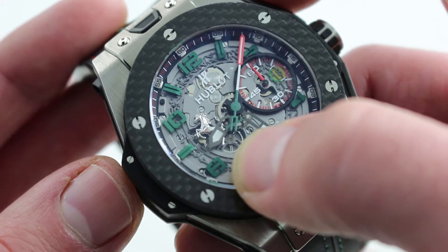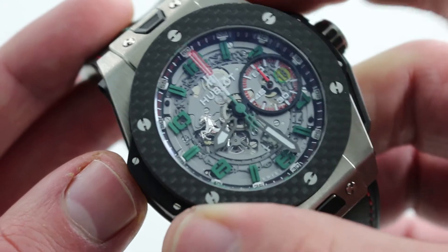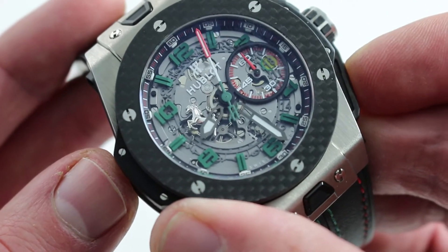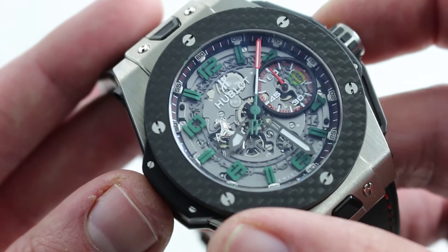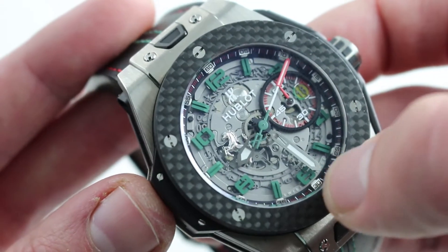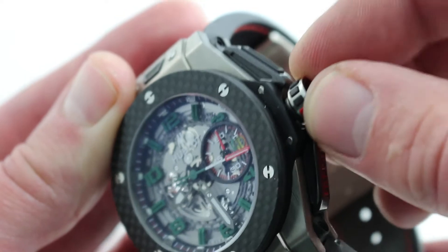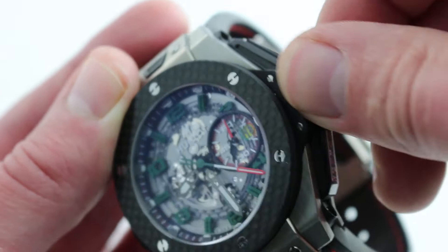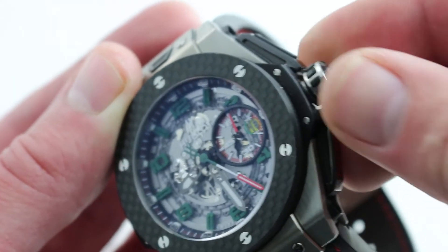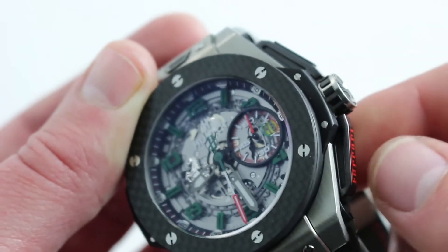The chronograph driving wheel is always propelled by the fourth wheel. I can disengage it and reset it. It's also a flyback chronograph, so I can zero it and restart it with a single press of the flyback button — you can see the pushers are both ceramic. The watch features a beautiful dark matte finish with polished contrasts, and the mechanism is protected by a unique crown with a quarter-turn design: a quarter turn locks and unlocks it. 100 meters water resistant, it is very easy to access because of the quick quarter-turn action — a mechanism that's both very robust and fun to use.